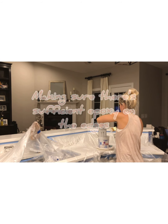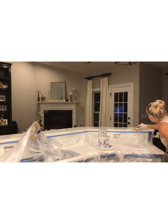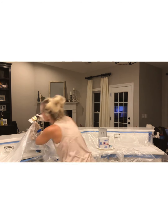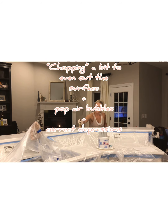The other tricky bit that Mike from Stone Coat Countertops warns you about is that it's difficult to keep enough epoxy on the edges, so you just have to go in after everything drips off and recoat the edges to make sure there's sufficient epoxy. And here's that chopping method that I was speaking of earlier.